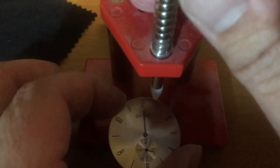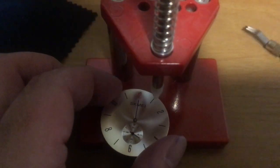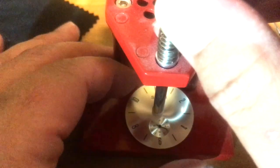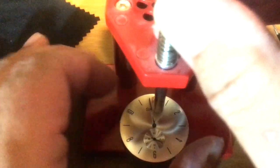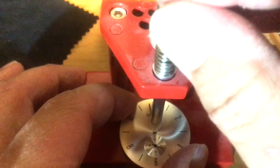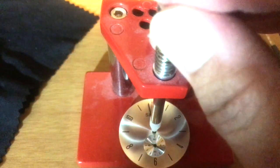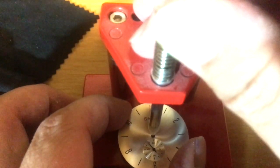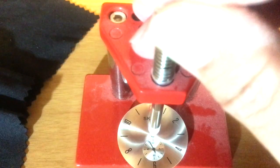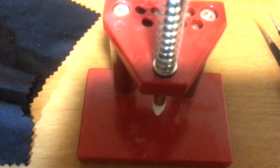Using this hand press tool I went ahead and set the hour hand at 12 o'clock, then followed that up with the minute hand also at 12 o'clock. Then just adjust it in place, push down and lock it in place, and hopefully that'll tighten the minute and hour hand a little bit better when you try to adjust it so it's not so freely swinging.